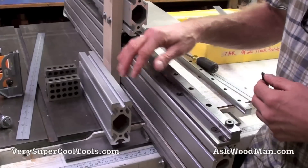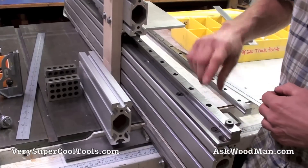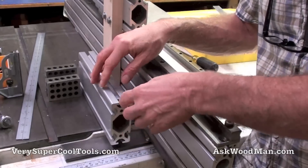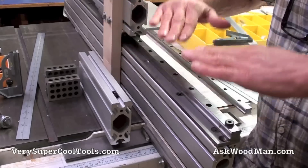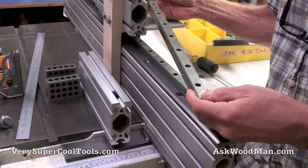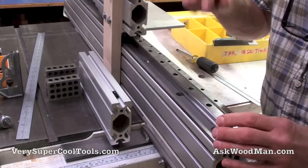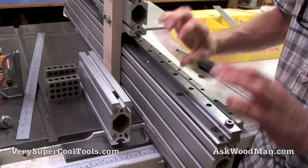The flat bar is attached to the top of the aluminum extrusion and overhangs the side slightly, so there's no interference off that face. It's attached via T-nuts, with countersunk cap screws that go down and engage the T-nut to pin it down. The bearing rail is then attached to the mild steel by placing it on, using a transfer punch to mark holes, then drilling and tapping the receivers to pin the rail to the bar.